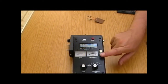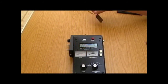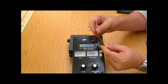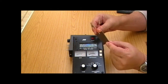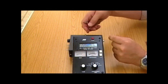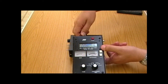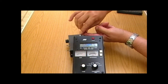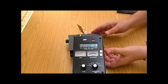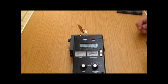We've got it switched on. Let's put it into capacitance mode. Here's the first capacitor — it's made from a piece of double-sided printed circuit board with two leads, one on either side. We've got the two metal plates and an insulated dielectric in the centre. If we clip it onto the analyser we should get the reading of its value in pF. That's reading 59 pF.